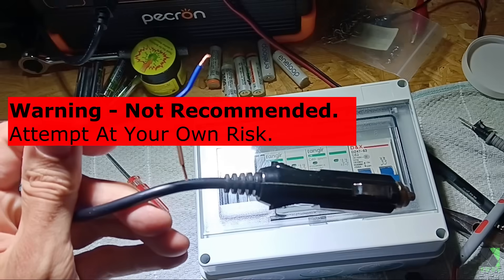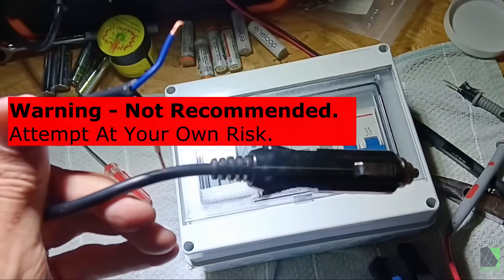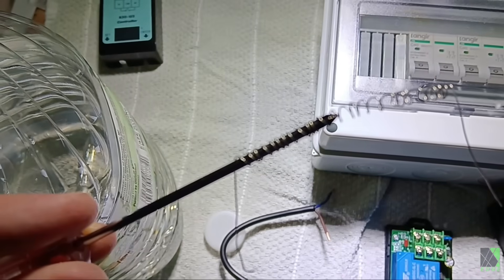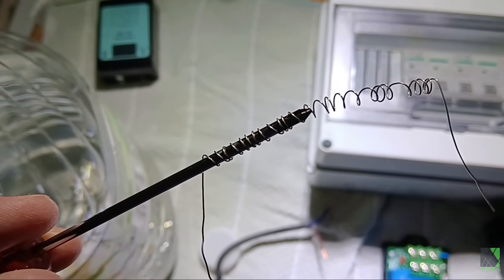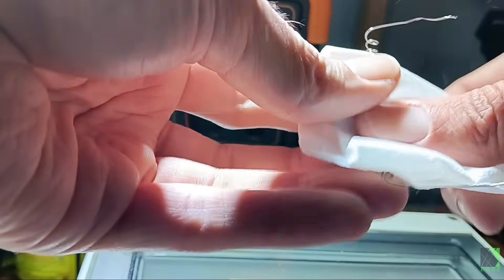As you know, this channel has an exemplary safety record. Until today. I just chopped off the supplied 12-volt outlet cord and clipped onto that. To make a fire starter, I took the scrap nichrome wire and wound it into a coil shape — not pretty, but I think it will work. I am trying to get it hot without frying the 12-volt outlet on the Jump 1800.